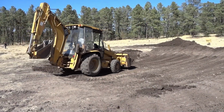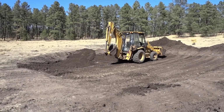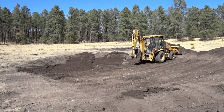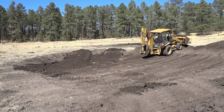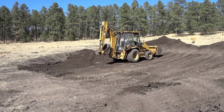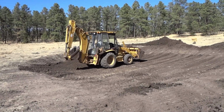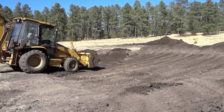It's best to build the wetland with a simple round or oval shape and a level bottom when using the compacted clay liner technique. This is because it's almost impossible to compact clay in dips and over ridges or around points and peninsulas. One can easily add ridges, islands, mounds, peninsulas, and shallow water bays by placing topsoil in the basin that's lined with compacted clay.